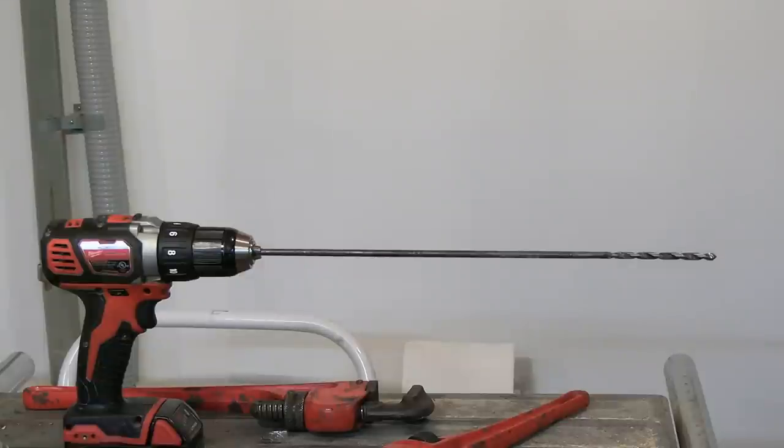Here's a drill bit familiar to people who do telephone installations — it's a 16-inch long by quarter-inch drill bit. This gives me a little extra reach, and the front of the bit is slightly tapered with a self-boring wood-boring tip. This gives me extra reach so I can get over the wall; rather than making a mark for the center, all I have to do is measure down from the top the five and an eighth inch and just eyeball it — the tape itself is an inch wide, so it's easy enough to estimate.